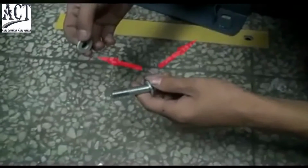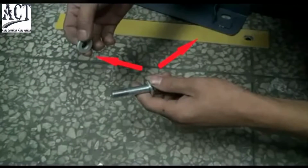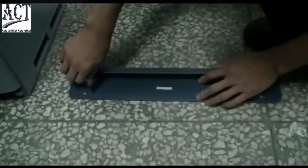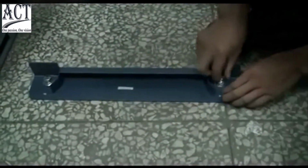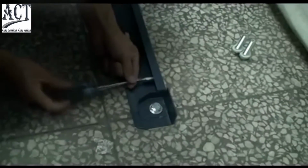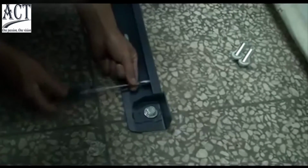Install the expansion bolt. Place the insulation covering. Install guiding pin to position the cabinet. Finally, take the insulation test. The two test connectors of the multimeter should be connected with the metal part of the base and the two expansion bolts. The circuit should be disconnected.